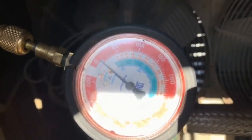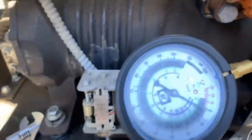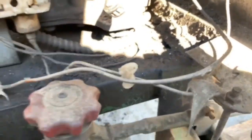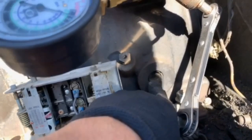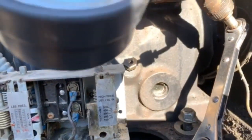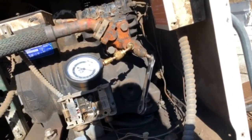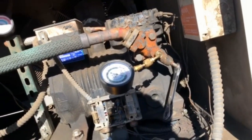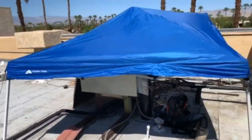Big leak — so now I'm going to get my nitrogen, pump this guy up with nitrogen, and find out exactly where the leak is. It could be in the obvious places — look at all this nastiness here, could have got rubbed out. But I really don't see any big signs of oil. I don't even know if I have oil in my compressor — we probably lost it all. I'd have to check that out. Time to get the nitrogen out, pump this thing up, and see what it can do. Let me unplug it since we don't need it running on a vacuum.